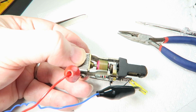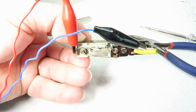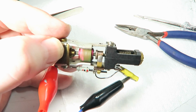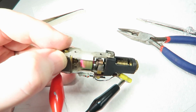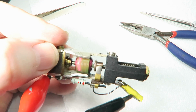The magnet was remagnetized in the way you've seen. I did have to remove the bolt, but kept the magnet within the frame of the motor when I remagnetized it. Remember, it's important to magnetize in situ. Anyway, the motor itself is pulling around 150 milliamps, which is more than acceptable for a motor of this kind, and it now sounds nice and smooth.